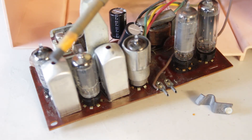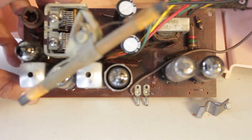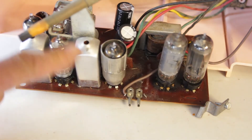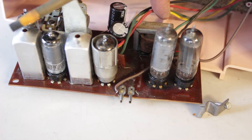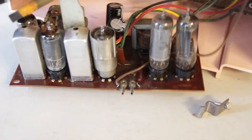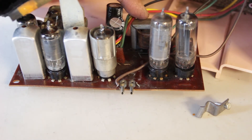So here's the main board for this radio. This right here is the antenna — the coil here is the AM antenna. This is the tuning capacitor that's used to tune things, and there are various tubes here for different applications. This is a transformer, and it's not a power transformer — it's used for audio transforming from the tube output to the speaker. All old radios have to transform the signal from the impedance of the tubes down to the impedance of the speaker.